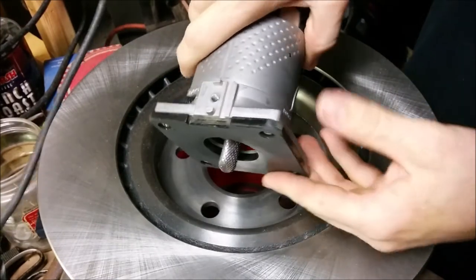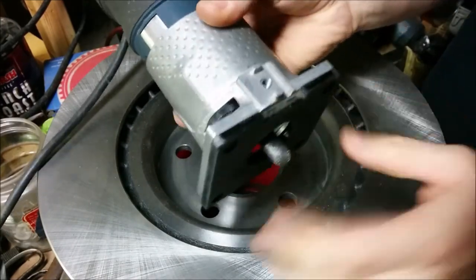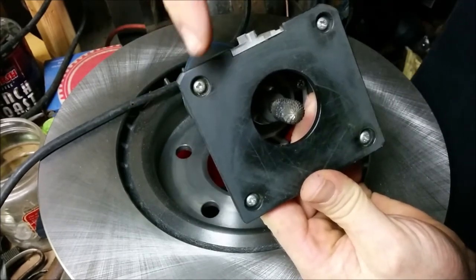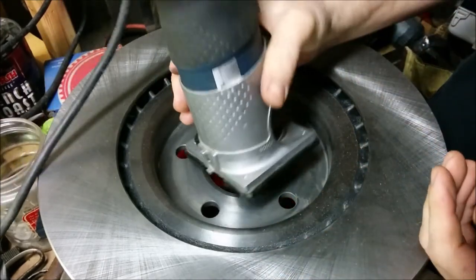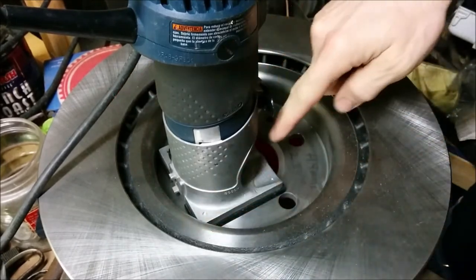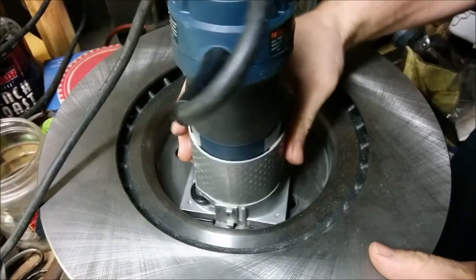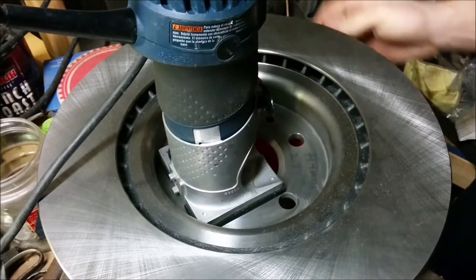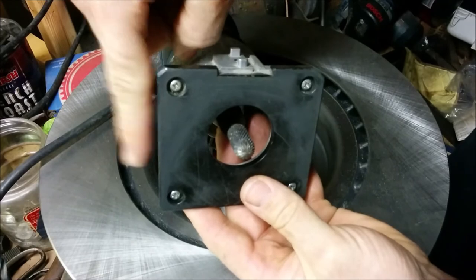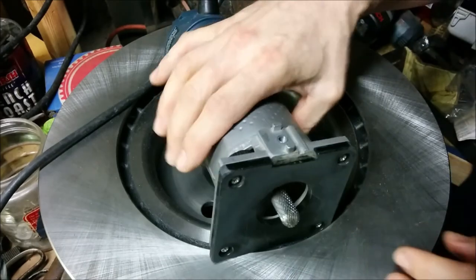Something I'm going to experiment with to make this more repeatable in the future — instead of keep sanding off these corners, I'm going to try loosening these screws and sliding the plate a little bit in that direction. The closer the cutter head is in that direction, the bigger it's going to make the hole. That's why shaving material off the corners — those corners being what rides on the outside — makes it cut the hole bigger. Sliding the whole plate by loosening the screws achieves the same result.